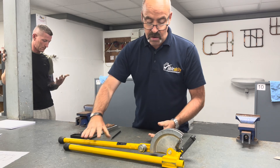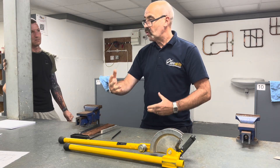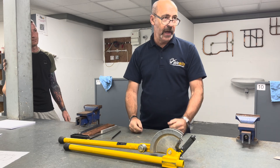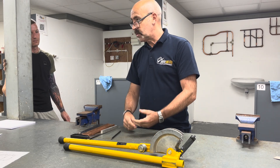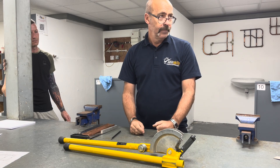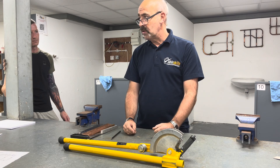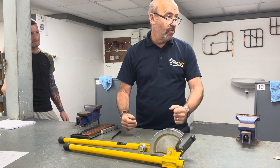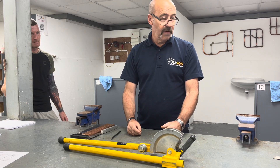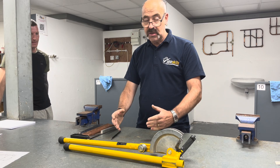It's a strange machine to start with — you think you're going to need three hands. Just concentrate, visualise the bend. We're going to do the four main bends: starting with a 90, then an offset, then a crossover, then a partial crossover. All bends are just variations of those main four. You have different sizes, add them all together, but the principles are all the same.